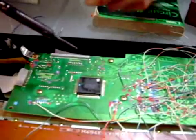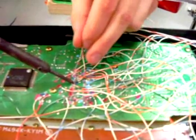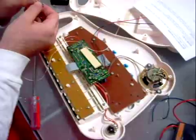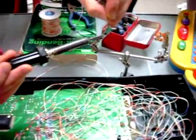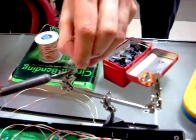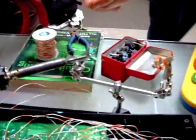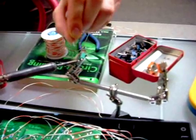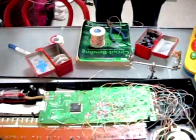I'm going to do that one more time. I'm going to bring the solder gun right to the location point, bring a little bit of solder, take away the gun, and let it solidify. Now without tinning these feet, there's nowhere for the wire to actually stick to. So same process — I bring the soldering gun to the location, to the foot. Bring the solder. You can see it transforming and melting. Same thing: I heat the location, solder, and just get a little bit on the foot there. Now we've tinned everything.